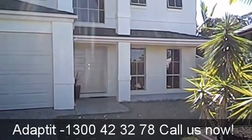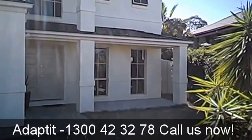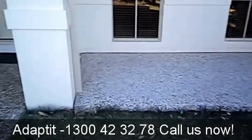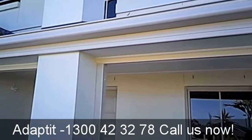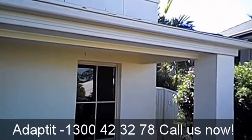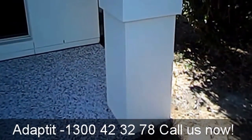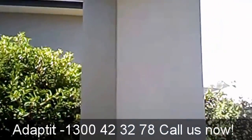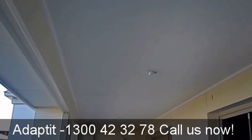We'll see you next time. Well, here we are at Warner — and can you believe that that section of roof there has been added on by us at the Adapted Group. We did fresh slabs joining to the existing, then we built the frame and continued the roof line all the way through to the side of the garage, and then tiled over the top matching the existing tiles. Then built out the columns, and the clients have since had them rendered and everything painted. It has just come up an absolute treat.